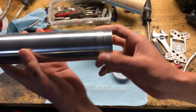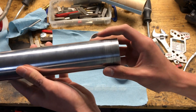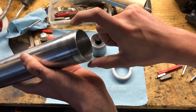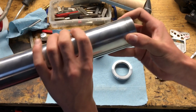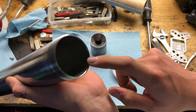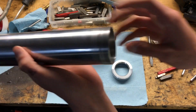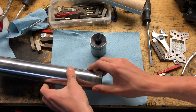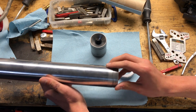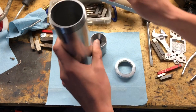This whole nozzle fits into the chamber here. The chamber is pretty standard 6061 aluminum, cut from some schedule 80 2-inch stock, which is obviously oversized by about a quarter inch. I've turned it down to 54 millimeters — two and one-eighth inch — on the OD, and the ID is 1.93 inches, giving us a wall thickness of around 100 thou on each side. It's rated for something like 600 psi, but this is a slow-burning motor and chamber pressure maxes at only about 400 psi, so that's not a problem. It's nice and lightweight because of the thin wall.